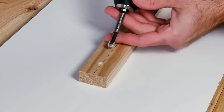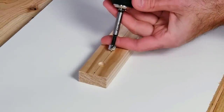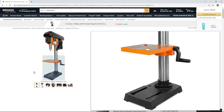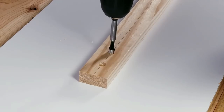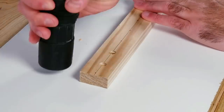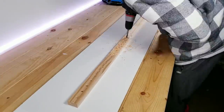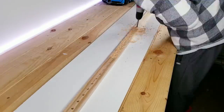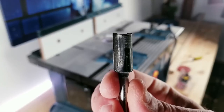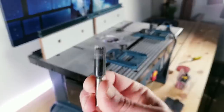When you're drilling the hole make sure to go down as straight as possible and go all the way through. Also make sure you have a scrap piece of wood underneath that you don't mind getting cut into. This step would preferably be done with a drill press but it worked out just fine doing it by hand. Next I'm going to be using a half inch dado bit to cut a very shallow channel so that the LEDs have a place to rest in.